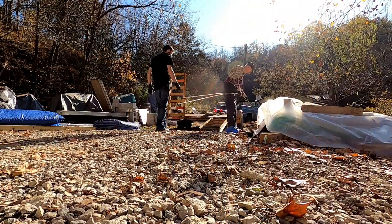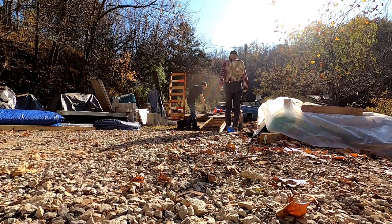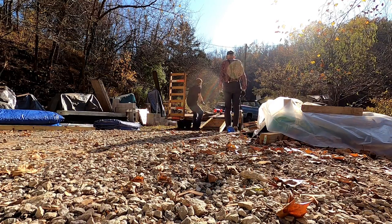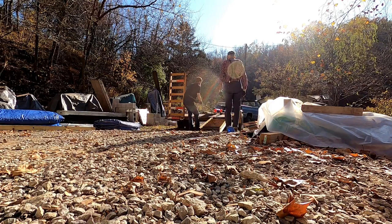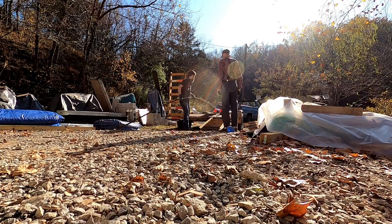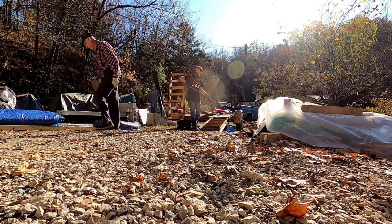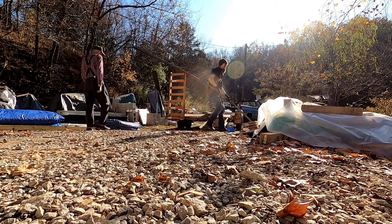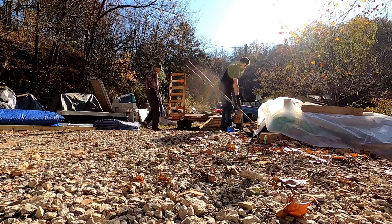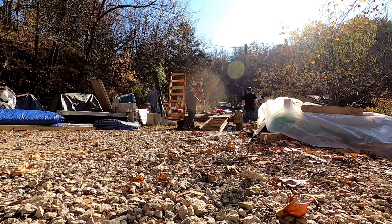So rebar is one of those things that's easily overlooked as far as its expense or its cost when you go to do a floor. Just the rebar for my pad, around $500. Now this is 60 20-foot sections of number 4 bar, and this should allow me to space my bar around a 2 foot center, and that should be more than enough considering my pad's going to be about 7 inches thick. From the research that I've done, that should be more than strong enough really.